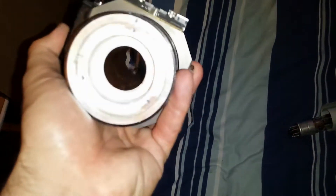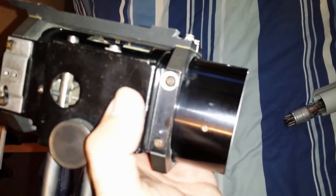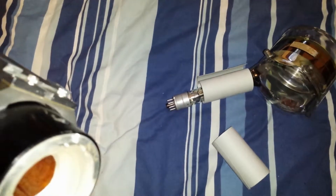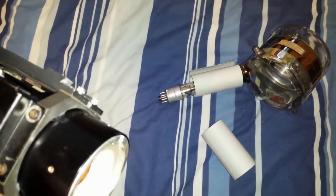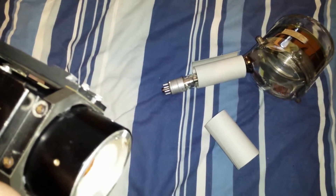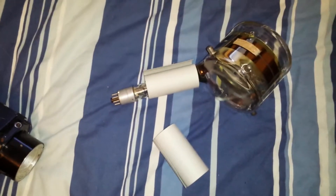The problem is this yoke is actually quite big — it's about nine centimeters in length, whereas the length of the actual yoke used for this tube is about six centimeters. I'm not sure if having that extra length of deflection would mess up the deflection of this tube, making it not produce anything tangible or recognizable.